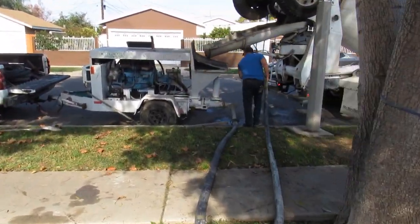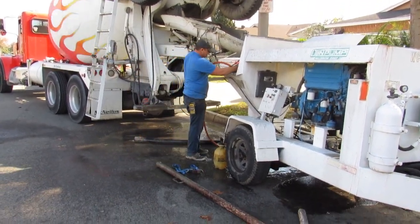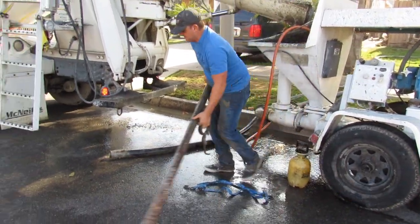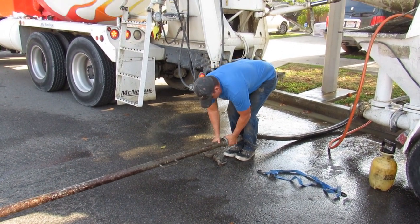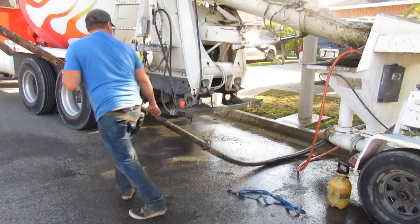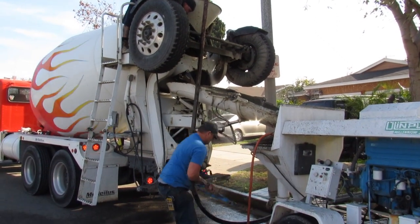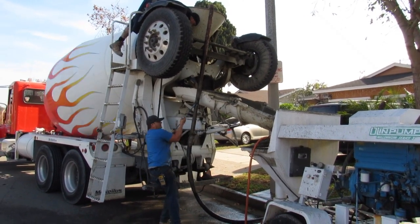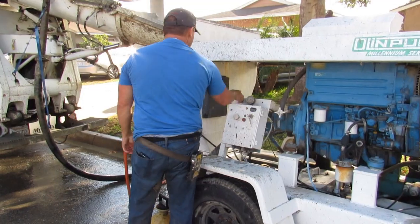Now I'm pulling it back to wash it out. What you do is if you have mud in your hopper, you pump the hopper all the way down but you don't cover the seats in the back. Then you fill it up with water three times, hook it to a washout hook, put it back in the truck, pump the water up in the truck, and clean your whole system. When you unclamp everything it's just — there's no rock, sand, nothing in it. I've strapped the hook down now for about a decade. It plugged in the hook one time and flew off the back of the truck. So after 10 or 15 years of not strapping it, I strap it now because it can plug in the top of that hook and take off like a torpedo.